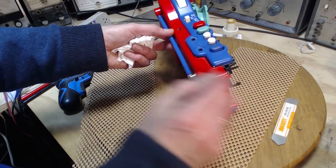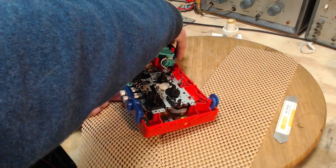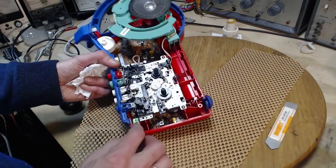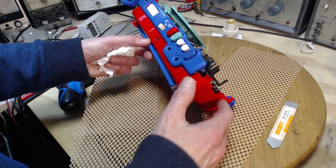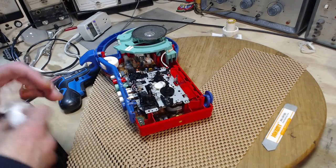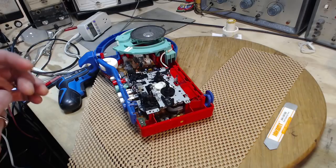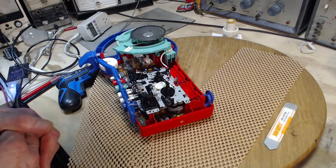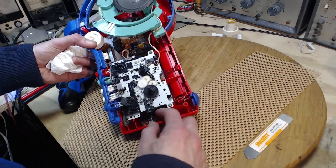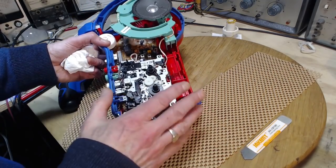Here's the antenna connection right in here, this little tiny board. These things swing around, so there has to be a slip-type sliding electrical connection, which is prone to trouble. This looks just fine — I'd almost put money down that no one's ever pulled this antenna off. Good. There's the AM loop antenna hidden right in here, so it definitely has a loop antenna. Of course it would. And here's where the power goes in, and sometimes this will come loose on the board, but I don't think there's anything loose here. The owner has told me the plan is to run this on batteries anyway.